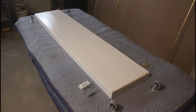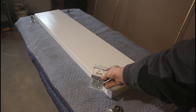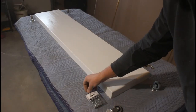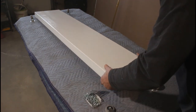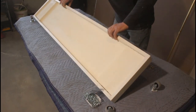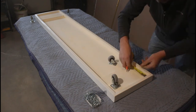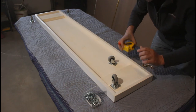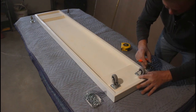It's been about six hours since applying all the finish coats on the wood. I can now go ahead and attach the caster wheels to the underside of the base. I'll be using a number 12 three-quarter-inch screw to fasten the wheels. Measuring in three-quarters of an inch from either side of each corner of the base, I mark and pre-drill all the screw holes, then mount the wheels.